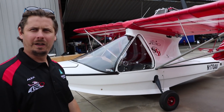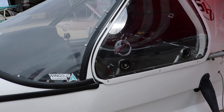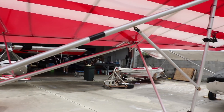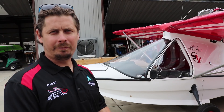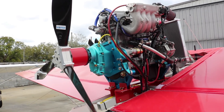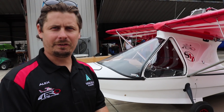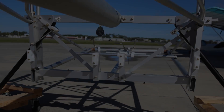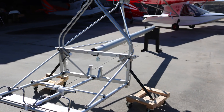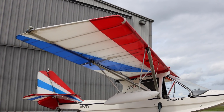So this is our Aventura 2. However, this is our S17 model, so it has a little bit more upgrades and things included in it — kind of a high-performance package for the regular Aventura 2. The airframe is very similar but has been beefed up a little to conform to the additional horsepower and torque that the Air Momentum engine puts out. This engine is 117 horsepower base and can put out around 130 once it's broken in. The aircraft is all built out of T6 6061 aircraft aluminum. It's anodized in and out, so very well protected. We also have a 4-ounce Dacron sailcloth, which is extremely strong. It's all pre-sewn, the customer gets to choose their colors, and then it's heat-shrunk and clear-coated for UV protection, which also prolongs the life of the sails.